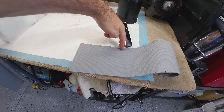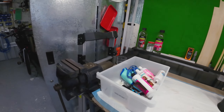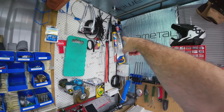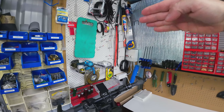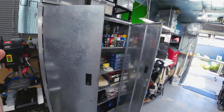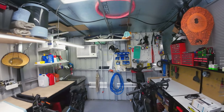I'm thinking maybe 100 by 100, depends on the foam piece — that'll determine it. Then I'll square it up and cut it. I'm also going to get some nice edging — I'll use 'no more gaps' and go around it to make a nice transition where all the glue joints are, once the glue's dry, just to make them all nicely rounded. I could use bog, I've got bog as well, but bog will probably crack whereas the caulk is a bit more flexible. So yeah, we'll get started on that.